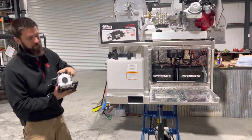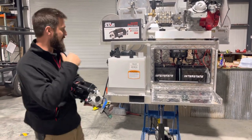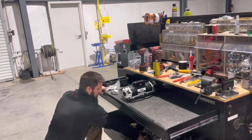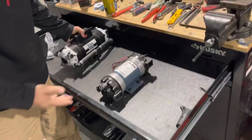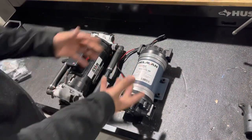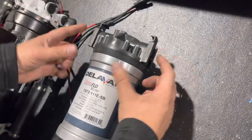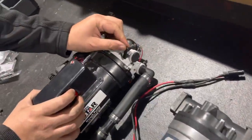There are a couple of things we're working with Northern to change, and I'll be upfront. This is the first of its kind — there are a couple other companies, Delavan for example. I wasn't that impressed with the Delavan because it's a 12 volt. They list a 24 volt version on their site, but I haven't been able to get one yet. It's the same concept — they Siamese two pumps together. The thing I like about the Delavan is it has a much stronger port design for incoming plumbing. It grabs better, it's got more engagement. So we like that; with the Northern, this fitting is a little bit flimsy.